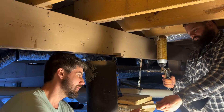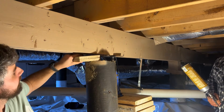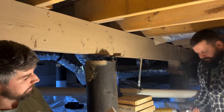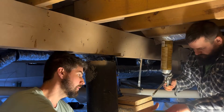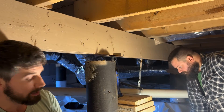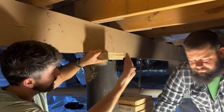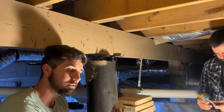Next up we build our shims. When you figure out how many shims you need, you know you need at least that many. We always glue and screw our shims together before we put them in there, because what you don't want to happen is if they're not glued and screwed, over time they could rotate, spin, or slide between one another. So we use a little bit of glue and a couple of screws to hold them together.